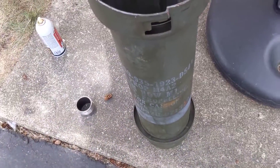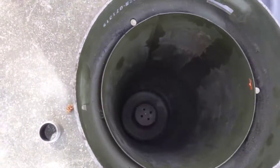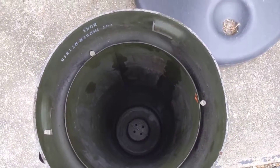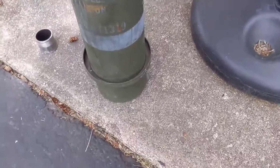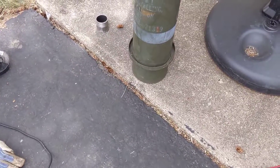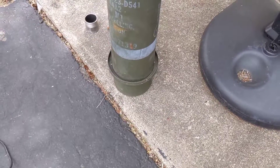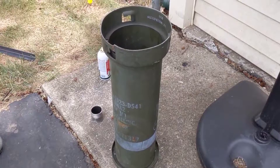Put an outlet pipe here and basically the gasifier is done and I can try it out. I've got a big bag of charcoal just waiting for it — that should be pretty cool. I also need to make some feet, because it's obviously not getting any air right now sitting on the ground. I'm going to make some stubby legs using half inch schedule 40 steel pipe, weld those on, and then finish the outlet pipe. It'll be good to go.